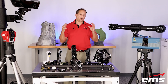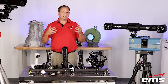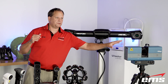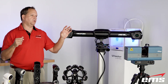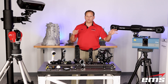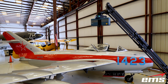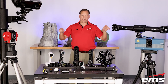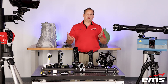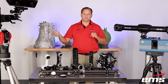If we want to do large scale scanning — and remember the laser tracker is one point at a time, very accurate — but what if you're trying to scan an airplane, a boat hull, a large vehicle, or a military vehicle? Then you get into something like this. This is what's called a long range hemispherical scanner, and this is the most accurate way to 3D scan large objects. This particular model is the most accurate product on the market for scanning. Basically this thing spins around, shoots out points, and scans everything in sight 360 degrees — thus the name hemispherical. Both of these systems are line of sight; you would move them around as you need to scan. Most scanners are line of sight — the only one really isn't is CT scanning, which we can also do to scan through a part and see inside of it.